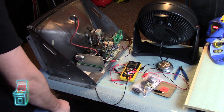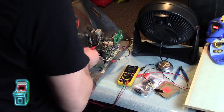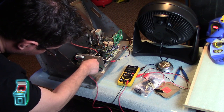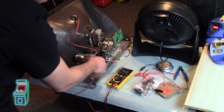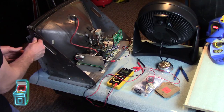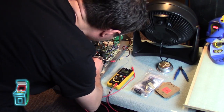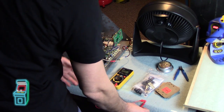This one is 123 DC voltage, so I'm setting my multimeter here. You can go on ground and touch the wire right here - the blue one. It doesn't really matter which one you do, but this is the one you're measuring from. If you're a little nervous about high voltage, you can do what I do - use these leads with one connected to the chassis ground and the other hooked where you need it. Either way, this is pretty easy to access on the K7000.